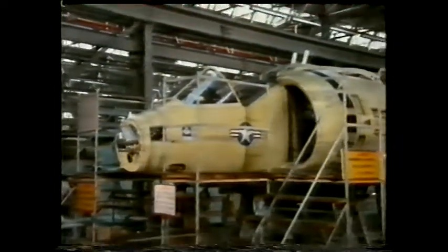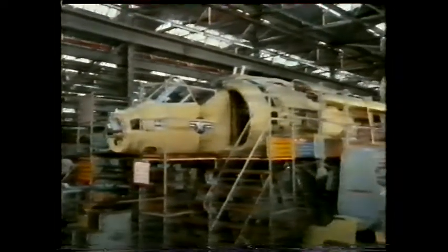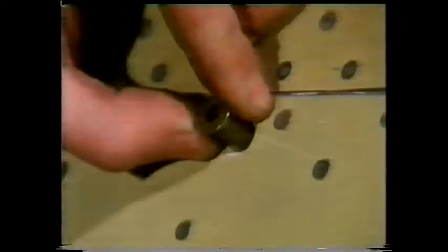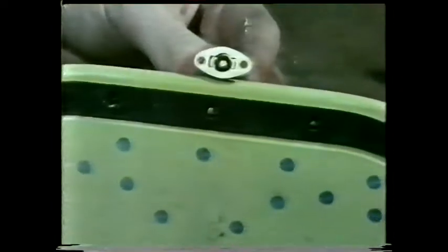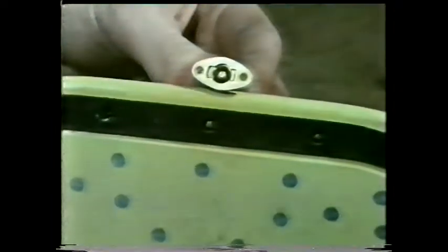In the aircraft industry, much stronger types of fastening are needed — the fuselage is mainly riveted. But where panels have to be removable, you need a strong fastening which will not only withstand shocks and vibrations, but also be easy to undo. Since the joint is only accessible from one side, this fastening is made in two parts — one half is actually built into the fuselage.